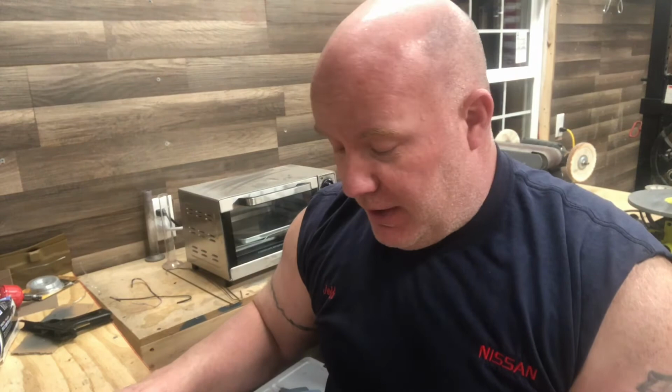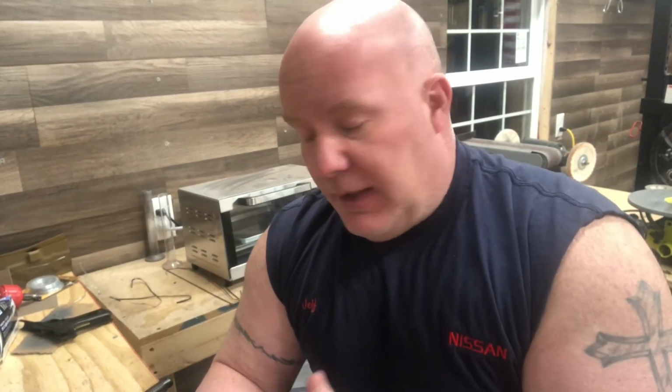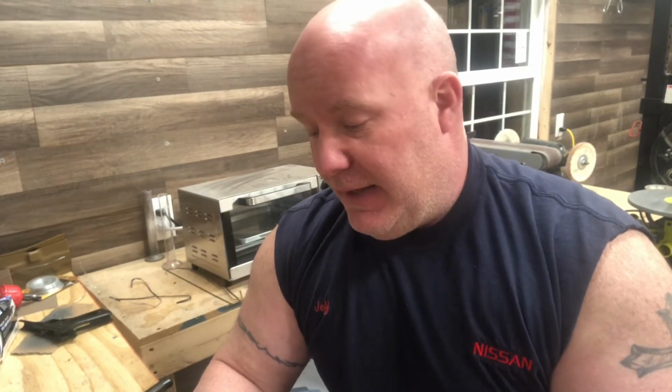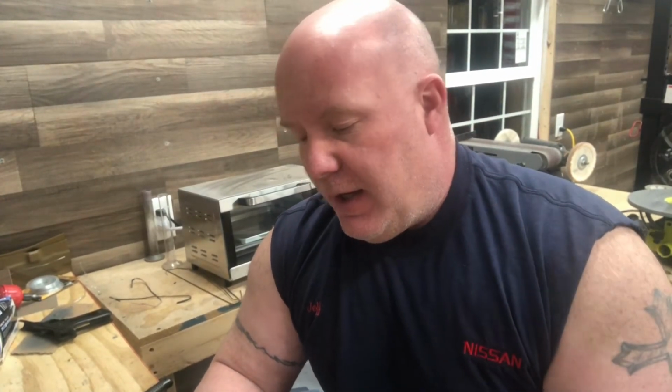Hey, just a little add-on to the video. I couldn't help myself. I went ahead and did some trigger work on this Fusion, and I wanted to tell you what I did and what the result is. All I did was I replaced the sear with a Cylinder and Slide ultralight sear. I stoned it the way I always stone it. Cleaned up the hammer hooks. The hammer hooks were in good shape. And I tweaked the sear spring just a little bit. And I put a short trigger in it, an STI short trigger.